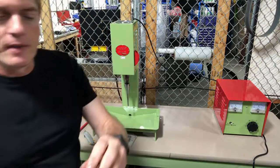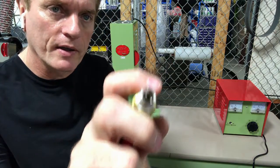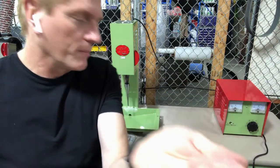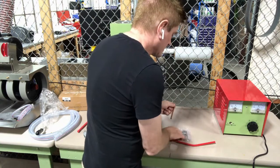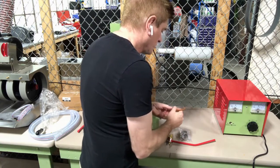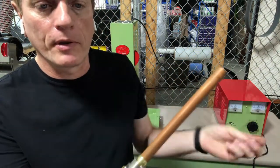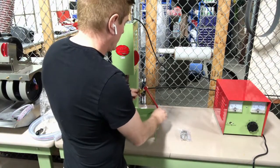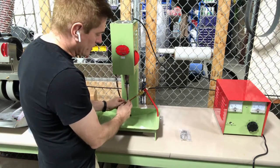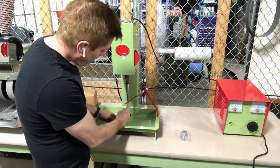If you look here, this is a little compression fitting. Right inside, you're going to see a compression fitting. So what I'll do is take this little brass tube — the brass tube is designed to get me a little closer to the actual head. I'm going to slip this brass tube in here, put my compression fitting on, then the compression ring, then the fitting. I'll need a wrench to do that, but essentially this allows me to get my tip really close, and then I'll cut this a little bit and bend it so that the water's coming in really good.